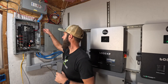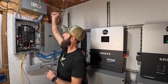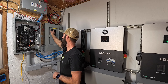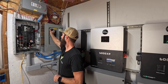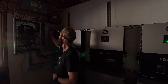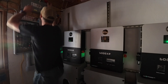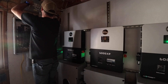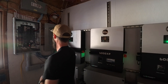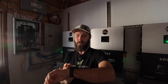So now what I'm going to do is flip off my disconnect here, and I can yank that transfer switch over there — or just turn off this 100 amp breaker. So I'm going to go ahead and flip it off. It's going to go dark. I'm going to turn this one off as well and turn that to the off position. Now I'm going to wait about five minutes and then switch things back over.